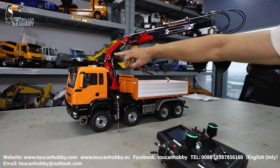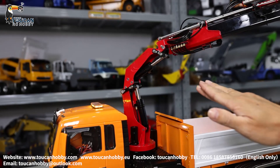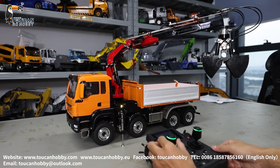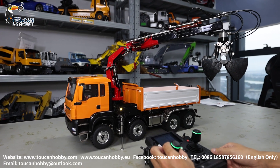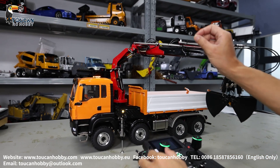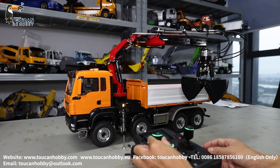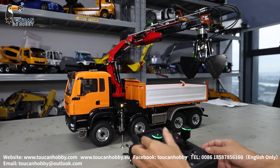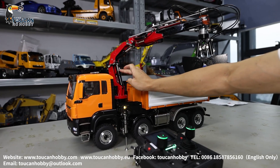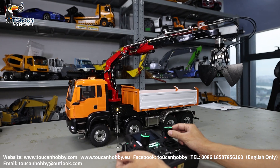But this middle arm — you see the cylinder has a horizontal angle. So it's not rising directly. With this angle, there's not enough power to rise the bucket directly. Let's see: rising — only a little power, just a little bit. So, what to do? We put the arm back, rising the middle arm a little bit — this one can rise. So we push out the front arm and do rising and lowering using the big arm. Now we can rise and lower with no problem.